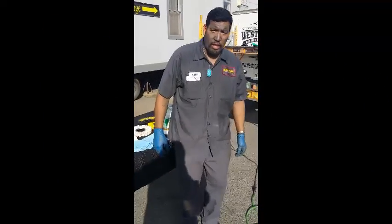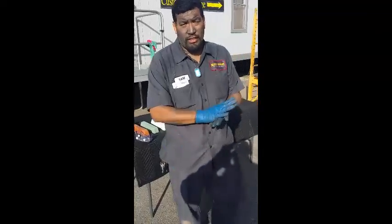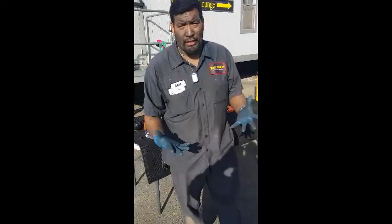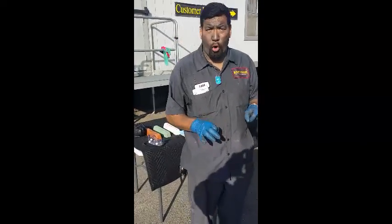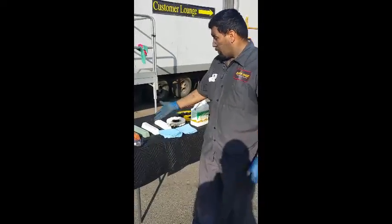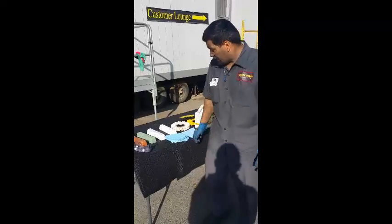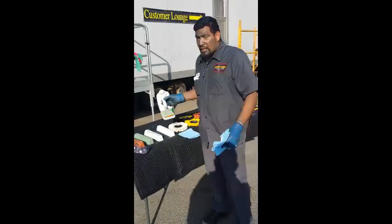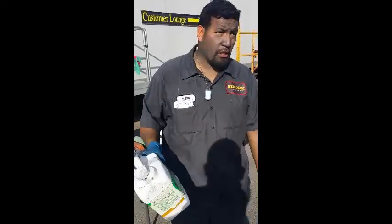Okay, we finished doing the finish on the wheel. We did the cut, then we did the strip down with the aluminum brightener mixture to get all the contaminants that are embedded in the pores of the aluminum. Then we did the cut with the brown, then we did the finish with the green and the white wheel. Now we're gonna clean it, because we left a lot of rouge everywhere. It's just the nature of the beast. That's just part of the process, you're gonna find it.